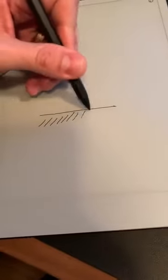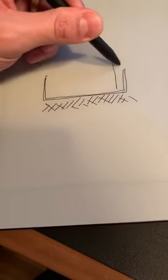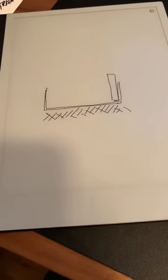Since Pete can't get in, he's sending me the questions that he's getting from people. So I use full depth granite curb on all my jobs. Will that work on hybrid as well? Yeah. I'll draw it out. We have our excavated area. This is our compacted soil subgrade here. We've got the edge ends of the excavation. We have our geotextile that in a normal installation would come up and wrap here. What we're saying is I'm putting in a full depth granite curb that may be going down all the way to the bottom of that excavation.